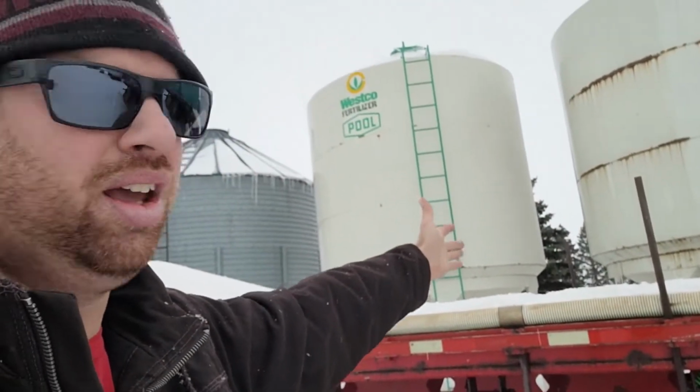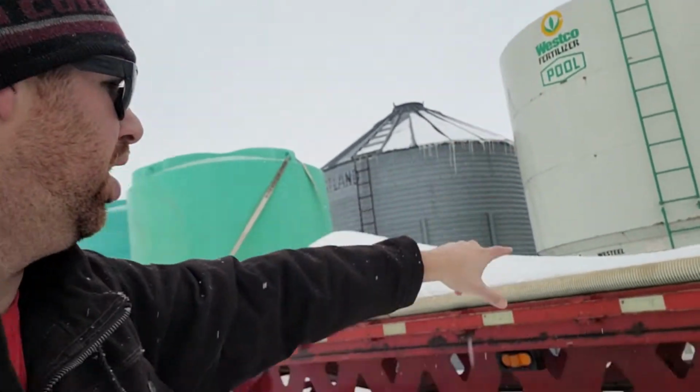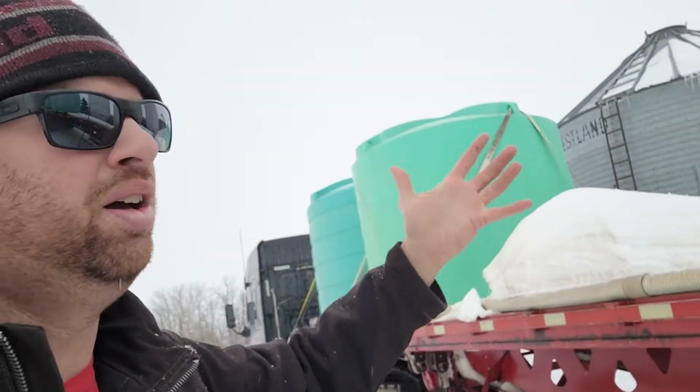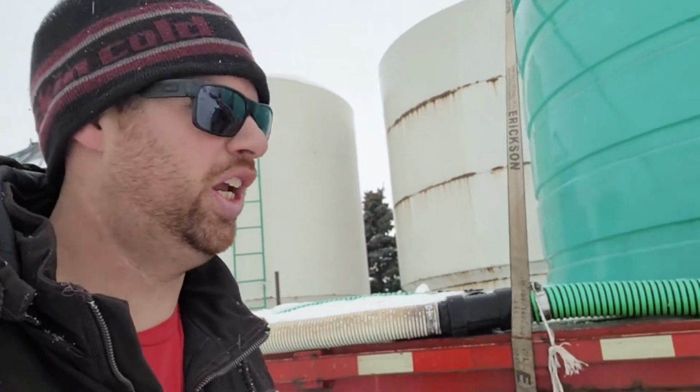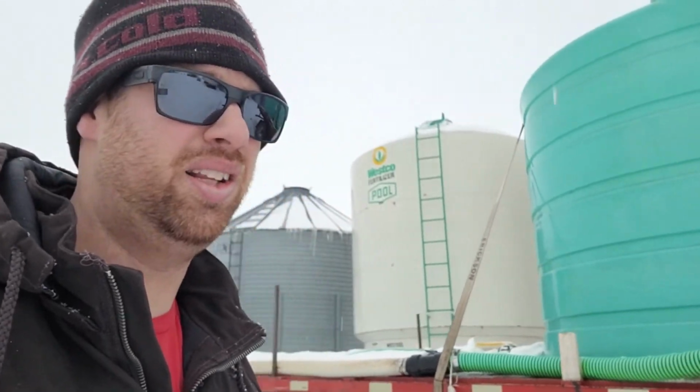I want to have a spot where you're going to get up and that's your walkway. So there's going to be some nice proper handrails. All these ones here are going to be fold down. The handler's going to be well laid out, plumbed in directly, have a strainer at a spot that's easily available so that it's not a hassle to change or to empty your screens out if you happen to get some algae in there. This is going to save us a lot of time, a lot of manpower, and it's actually going to give us the opportunity to spray more, as far as we're going to have less downtime, we're going to be able to spray more water, and we're going to be able to potentially look at land that is further away